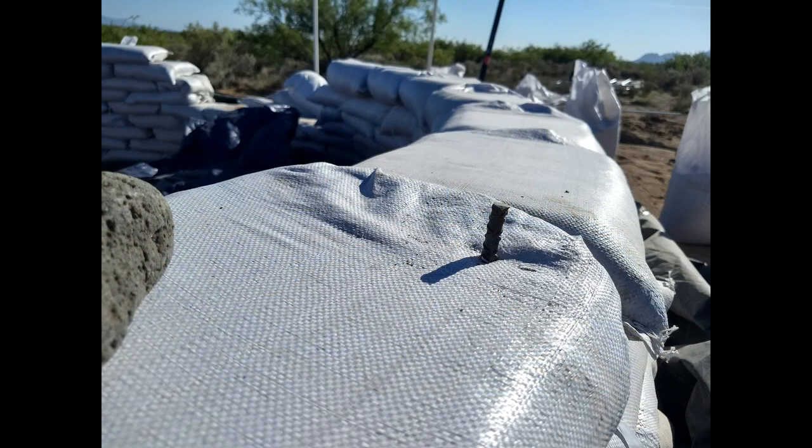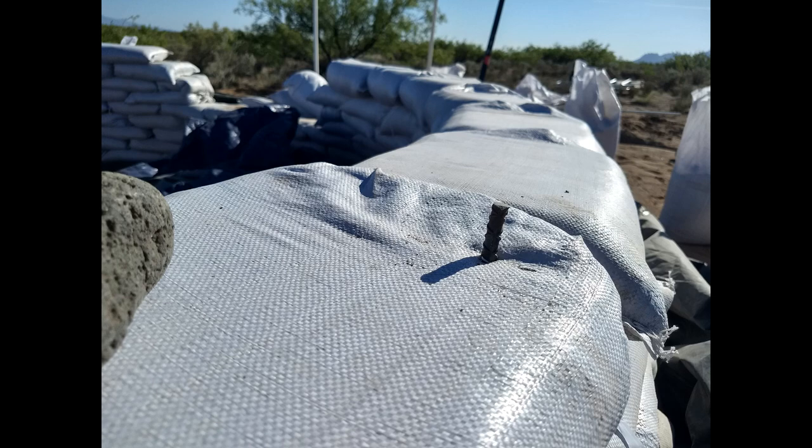After having the experience of getting this far, I began to have concerns about the stability of the earthbags, mostly because my soil was not very clay-rich. So I decided to drive some rebar through these foundational layers to hopefully add more stability.